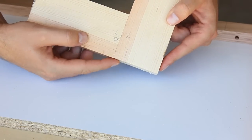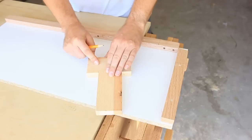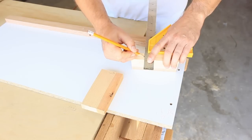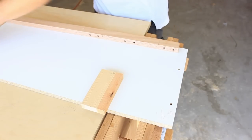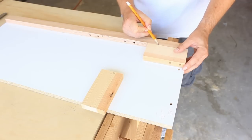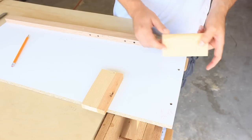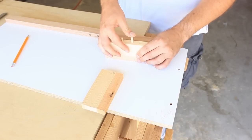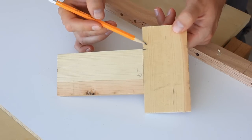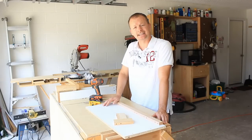There is my dowel joint and that doesn't look half bad actually. Now let's say I want a dowel not at the end of two pieces but in the middle of one. I'll mark one side of the adjoining piece and remove the top section of the jig. On my example here I have to transfer the mark to the back side — since I had to flip the first piece I have to flip that second piece too. Remember that mark I pointed out earlier in the video? It comes into play now. Line up the mark on your piece to the mark on the jig.